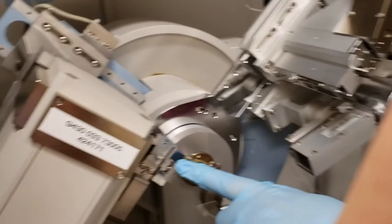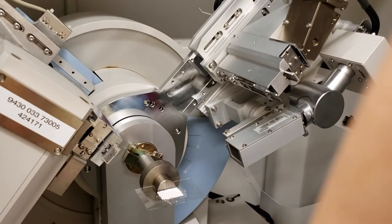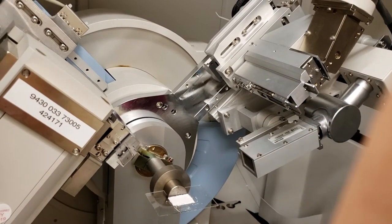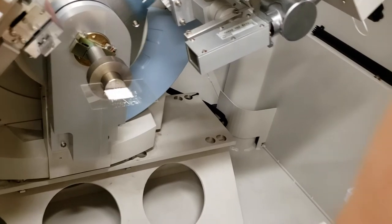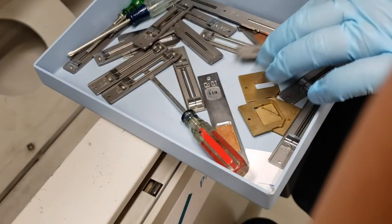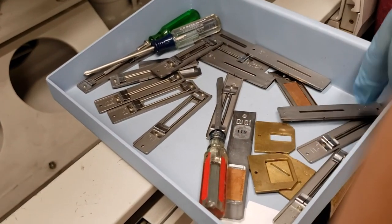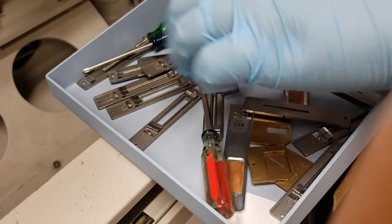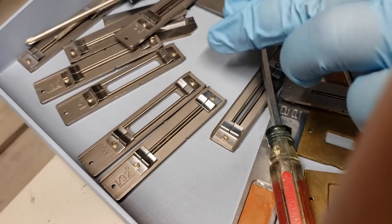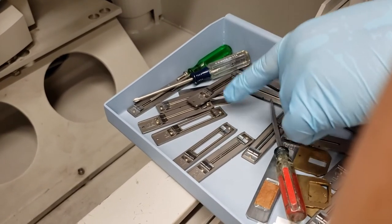So we have got the three slits: divergent, anti-scatter, and receiving. All three can be swapped out. Our defaults are one-half, one-fourth, one-eighth — decreasing by a factor of two each time. If you look on the side of the XRD, there is a little shelf with a whole slew of slits you can choose. We go from as big as four degrees all the way down to as small as one thirty-second of a degree, going by factors of two: one thirty-second, one sixteenth, one eighth, one fourth, one half, one, two, and four.